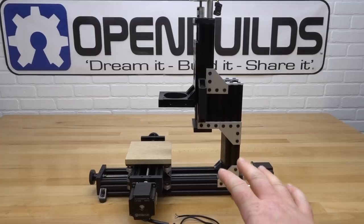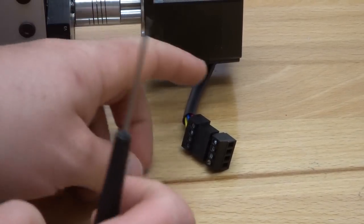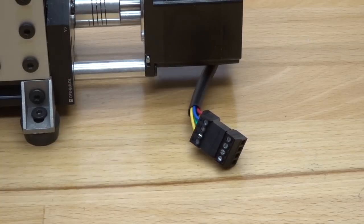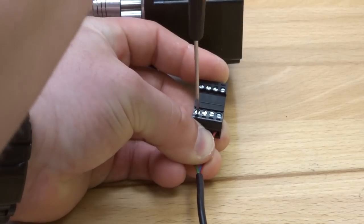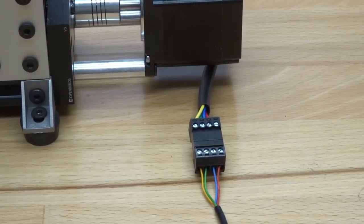I've turned the mini mill to give access to each motor. Next I'm going to move to the y-axis motor. Coming to the y-axis motor, once again we're going to loosen all the pins on the connector attached to the motor. Looking at the wire colors, we're just going to match those colors again — red, blue, green, and yellow, right to left. Tighten down those pins, give those a tug, and that looks good.